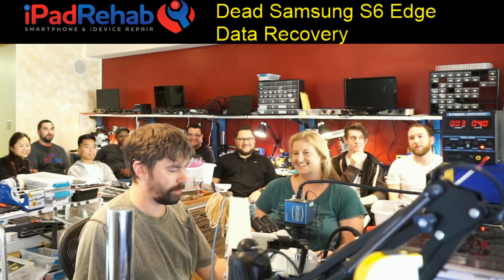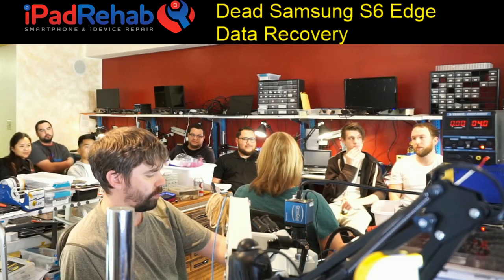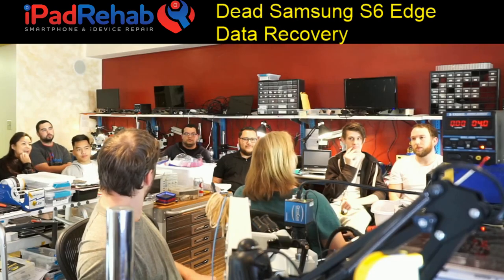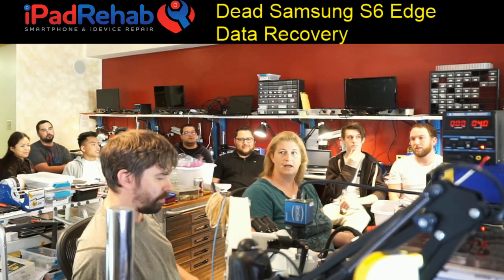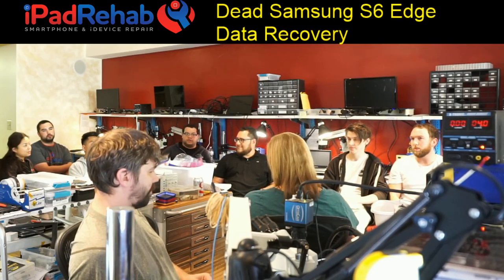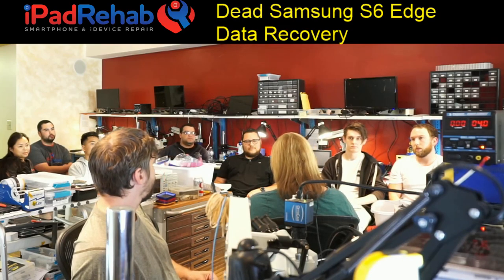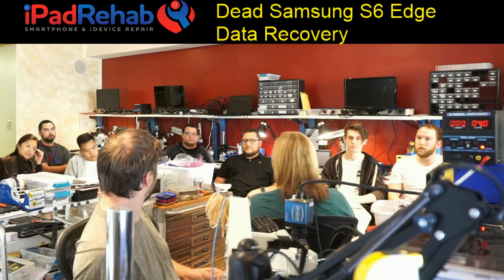So guys, what do you think? If you have current consumption before prompt to boot, what does that mean? Short — because current is going straight to ground, showing a lot of activity. Current is going straight to ground, the absence of prompt to boot is inappropriate, so therefore a short-circuit somewhere on something directly connected to the battery.